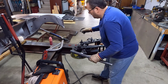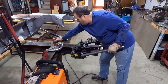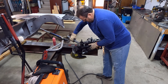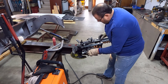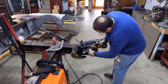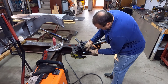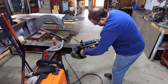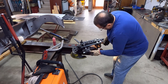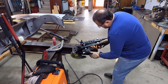And so we put this back. We're going to drop a little bit of oil on it. We'd like for our die to last a long time. And in you go. Right. So there's that line, and this is the die guide that we're talking about. Because what we do is we drop that line right back to that guide. It's just really easy the way this works. Right, tighten her up there. I'll initiate. We want it when we put tension on it, that line is going to be right on the edge there. And that's it right there.